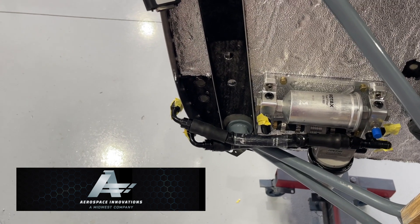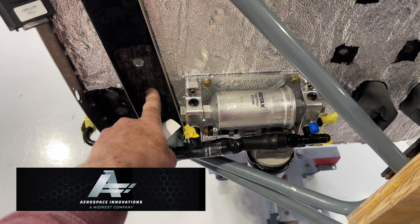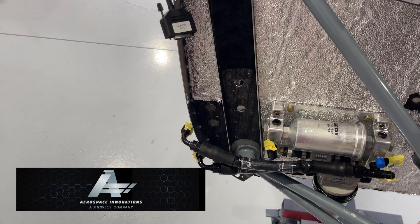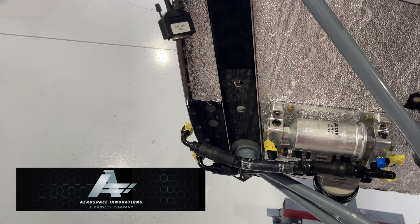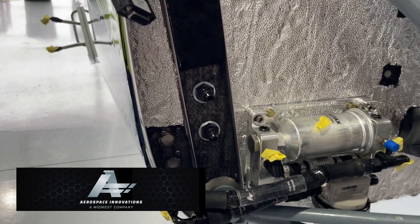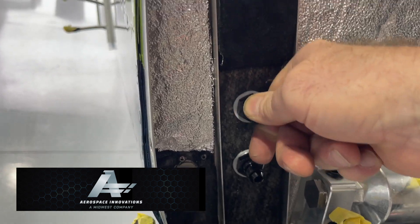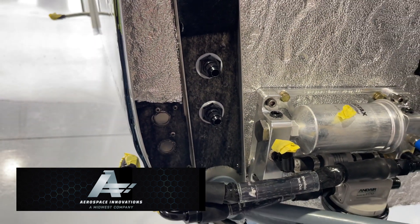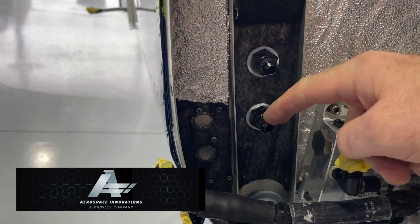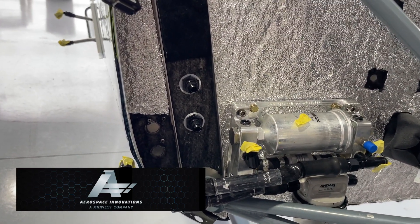Putting the bulkhead fittings into these two openings in the channel gives much more backing — almost acting like a doubler — and more strength to hold them in place. Now that they're installed, this is a much better connection: no give, no side-to-side or up-and-down movement. I'm feeling much more comfortable. I mean, that feed line right there is your lifeblood — it's the feed line from all your fuel tanks, so it has to be perfect.